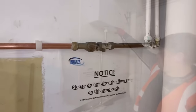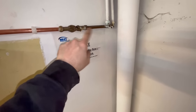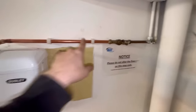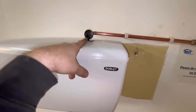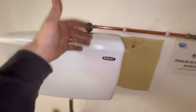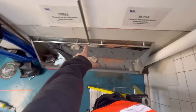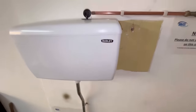Water is all back on. I did leave the stop tap in — I could have took it out but I thought I'd leave it just in case. New bit of pipe on there, and that's the trickle valve which goes in the top. You just adjust that so it fills up to a certain time before it siphons. That's it all in and tightened up. That was easy — a lot easier than what I thought. Never done one before, but nice and easy, to be fair.